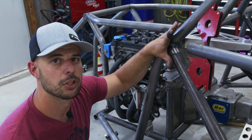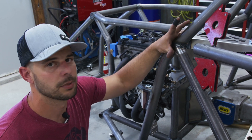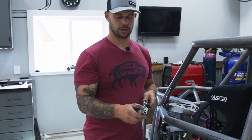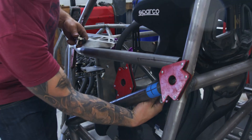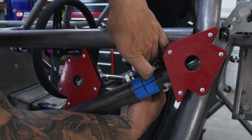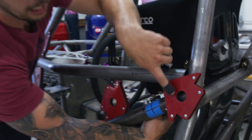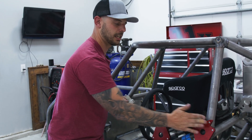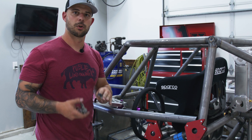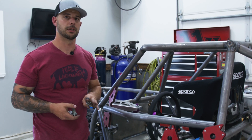We're going to be putting in a hinge in this area, and I'm going to make it with some bushings so that it's structurally sound and can maintain an impact. Since we're trying to protect the driver and the passenger, we don't want this to be on some door hinges. In the back here, I actually purchased a standard door latch for an automobile, but we're going to be flipping and reversing them — putting this on the back side. The pin for this latch is going to be mounted to this upper bar right here. This pin is going to be dual purpose for the mounting, and we're going to gusset this area so when you shut the door it has a positive flange on this side that it won't go through, and the latch with this pin is going to make it so the door won't open up.